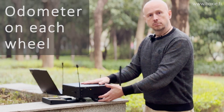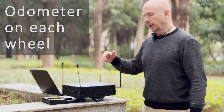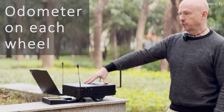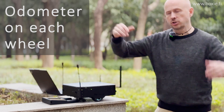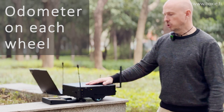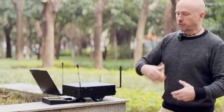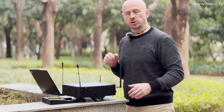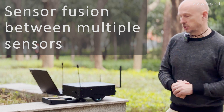There is a very precise odometer on the left wheel and on the right wheel. It measures the drive when, for example, there's occlusion and beacons are not seen because the distance is very large. The robot can drive for a few meters using purely the odometer and still not be lost. It accumulates error, but this error is then cancelled by the ultrasound system — once again, a sensor fusion-based system.